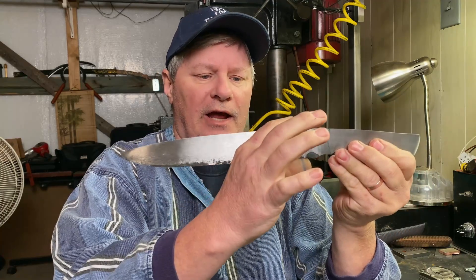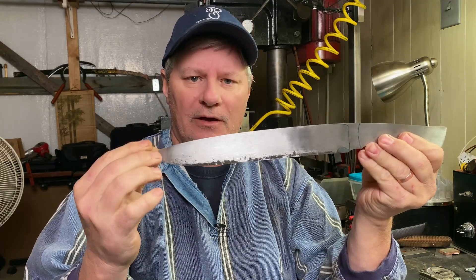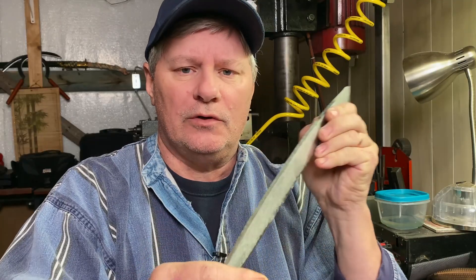It's about an inch and a half here and it kind of tapers down, which is what I want. We've got a slightly forged distal taper in, and I will finish that when I start doing the grind — I will actually grind in a little more distal taper. I want this blade to be tapering in both directions toward the point. I have marked this edge, and I'm going to mark some center lines and start doing our rough grind. Then we'll move to heat treating.